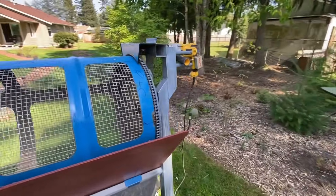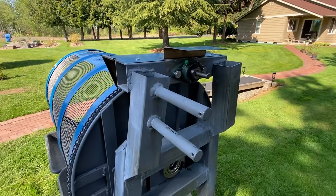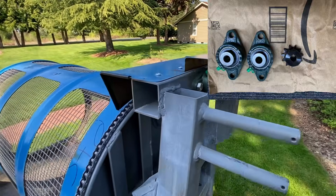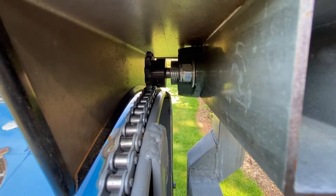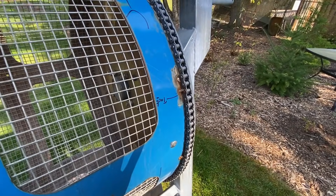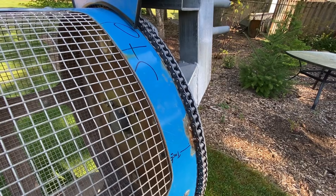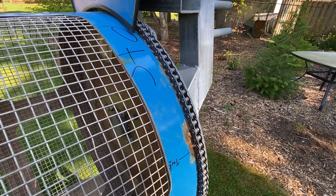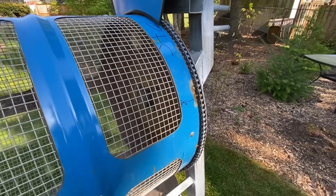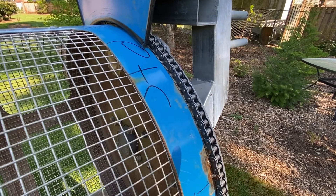The car spindle itself is sealed and has zero play in it. This half-inch rod I had on hand; the pillow blocks came from Amazon — I'll insert a picture of that along with the 11-tooth sprocket, and they're just held on with set screws. I'm using a number 40 chain welded to the drum as the gear. The way I did that was to wrap the chain around the drum, cut it so the two ends were as close as possible but smaller than a master link, then inserted the master link. It was still pretty loose, so I pulled the two ends together as tight as possible.